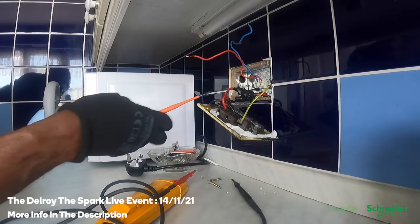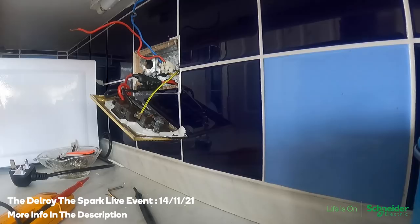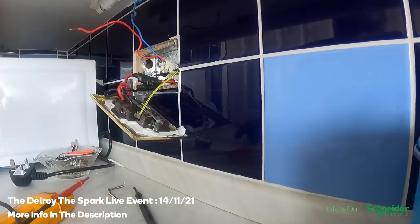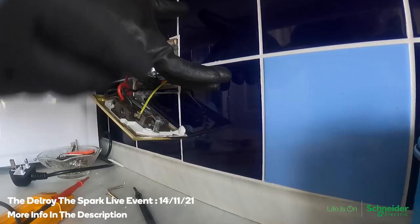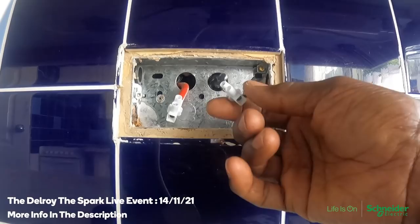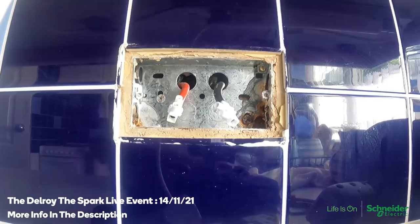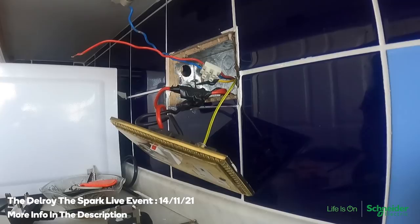Is there anything in the kitchen that should be working that's not working? Because this cable here — I wonder if that cable is what they've brought to this point. Whatever it is, it's not done properly, so I'm going to disconnect that and leave it out. I suspect that one goes over to there. What they've done is put a 3-core 1.5mm, connected it here, then brought it behind there and connected it to some 6mm or even 10mm flex, connected it behind there for this socket. It's a joke. It's a good thing we found that — we can just cut that out and mount another socket next to it.